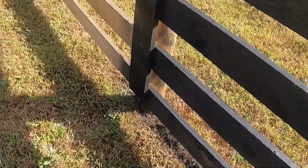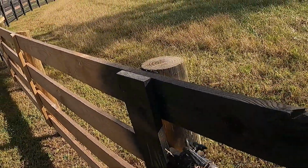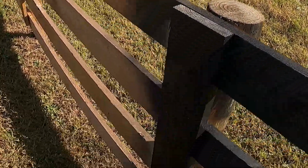downward angle, and then here I usually flip it and come down across like that to try to get that straight angle without me stooping all the way down. Then I cut in the fascia board, so I'll come down the edge of it and I spray in like that to try to get some paint to penetrate in the gap.